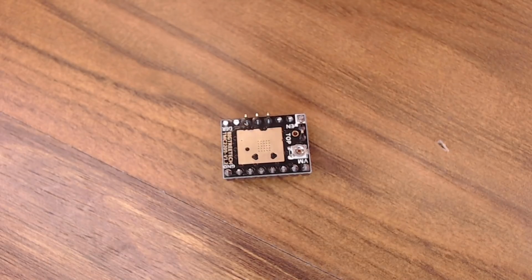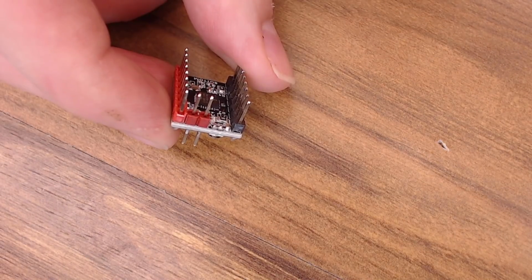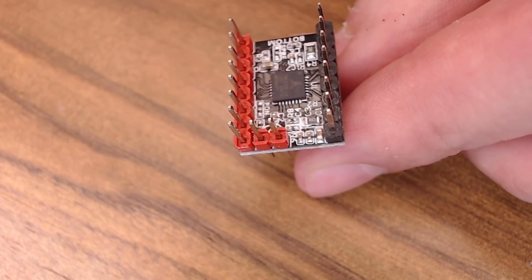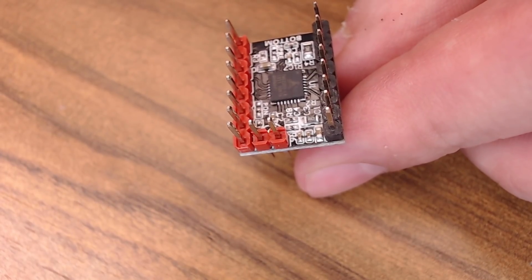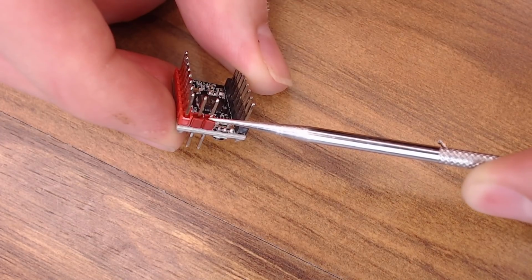Now, if you don't want to use sensorless homing, we are not going to be using it on Z or E. Because of the consolidation on the SKR 1.4 board, you now have to alter these pins. On the 1.3 board, we had that diag jumper that we could remove or put on if we wanted to change the state. Here we don't have that option, so we have to remove this pin. You can either just clip it, or you can try to desolder it. So if you're not using sensorless homing and you don't remove this pin, your end stop's going to stay open and your axes will crash. And that could be pretty bad. So again, anything not using sensorless homing, you have to remove this pin to use a 1.4 board.